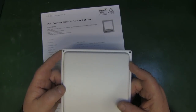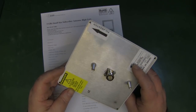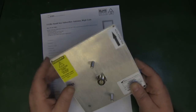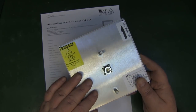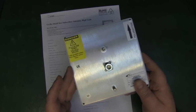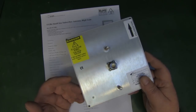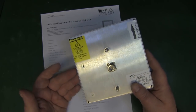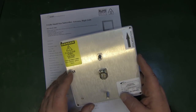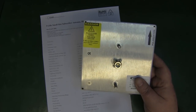To get into this is going to be a little bit tricky — I'm going to have to drill out these rivets carefully because I want to keep this and possibly look at the design in the future. It's not held down with screws as you'd typically find, and it's probably got some sealant around the sides as well because it's designed to work outside. I'm expecting the PCB to be a little bit different — something that's as expensive as this should use a low loss type PCB, not the cheap PCB you'd normally find a panel antenna etched onto on eBay or Amazon. Let me drill these out and then we can lift the lid.